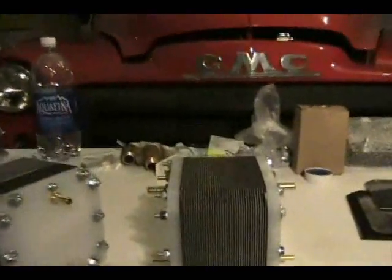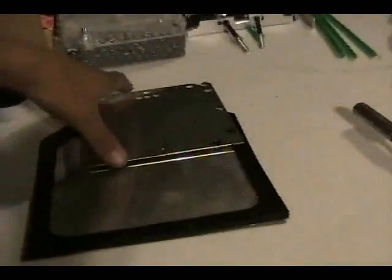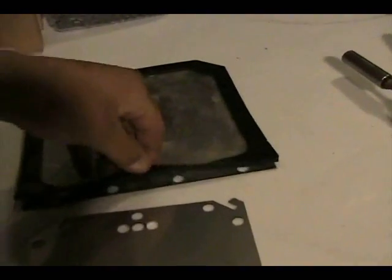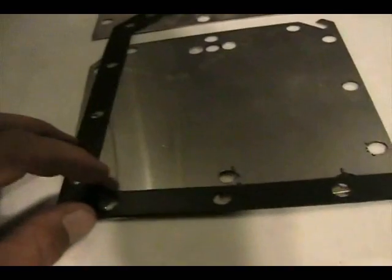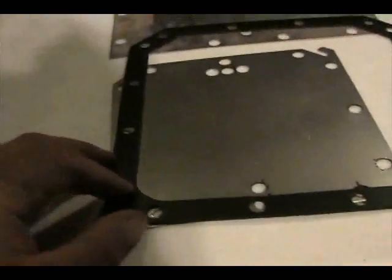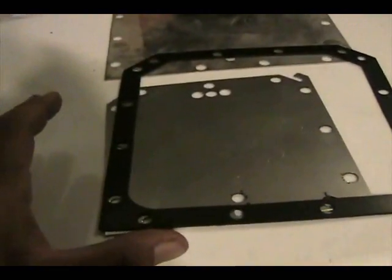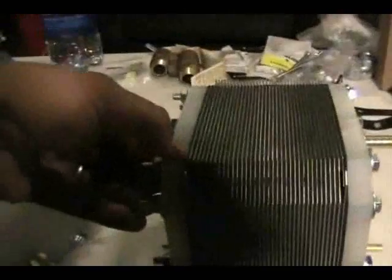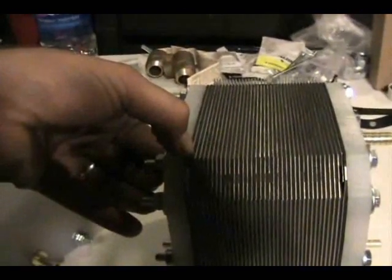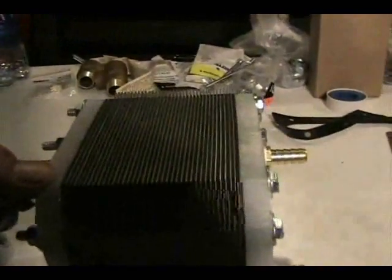Less resistance is a good thing in these cells. There is a certain amount of realism you can achieve with that. As you can see on this 6-inch plate, here's an 8-inch gasket — when you lay it on there, it creates a small space, a sixteenth of an inch from plate to plate. That distance needs to be maintained so that the optimum voltage for the entire assembly is also optimum for each individual cell. A cell is technically any distance between any two conductors in which you're passing electricity through an electrolyte, so this is actually 35 cells all stacked together the way it's configured here.